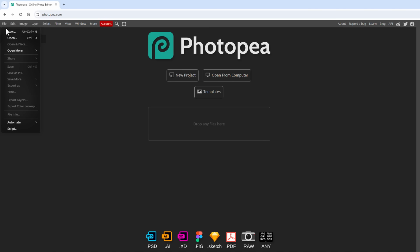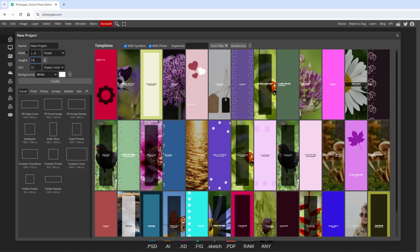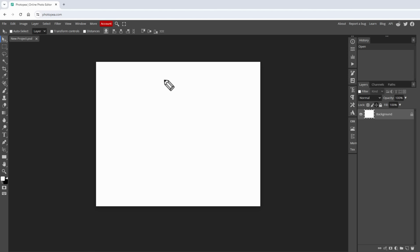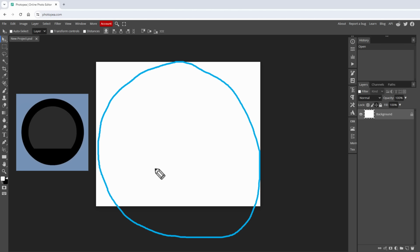I will keep using Photopea, but this time I will create an image in the full screen resolution, being 240 by 198 pixels, which is about this size. But if I look at the actual display, it looks something like this. So imagine this is the circle, so this area is actually not present on the display. If we want to align something to the center of the screen, we cannot align it to the center of the canvas, but we need to align it to the center of this circle, and we of course need to keep in mind that anything inside those areas will not be visible.